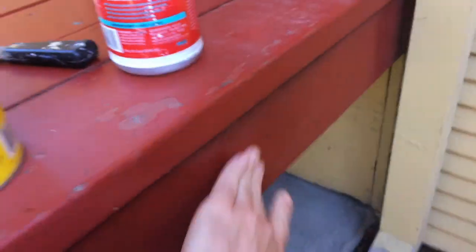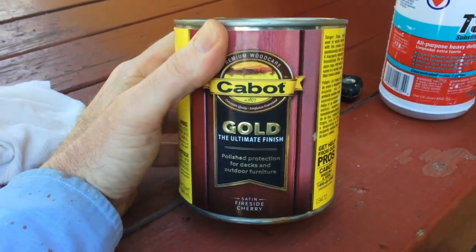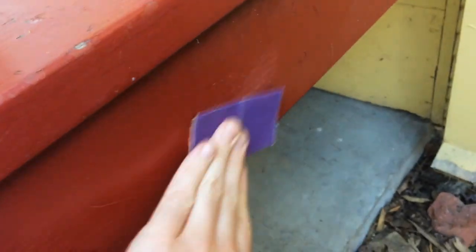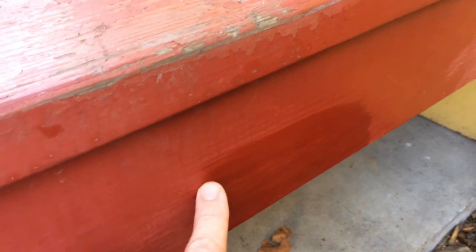The job is an old oil-based alkyd, mineral spirits paint thinner cleanup job. Dave at Kelly Moore recommended that I try this on the painted wood. It says on the can it's meant for untreated wood — of course, this wood is treated. So what I did yesterday: I came out here, a little sandpaper, just sanded, scuffed it up, used some TSP, wiped it down. And I brushed some of this on — look how nice this is going to look. I can tell already this is going to work fine.